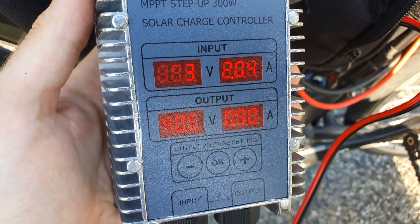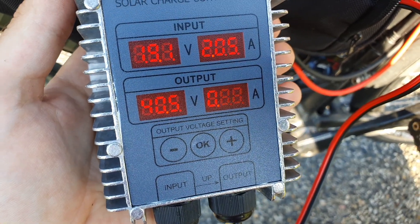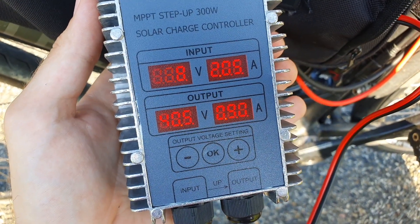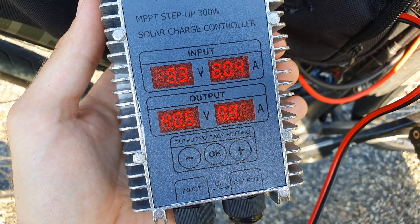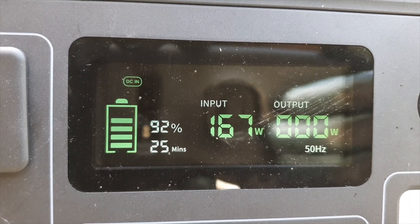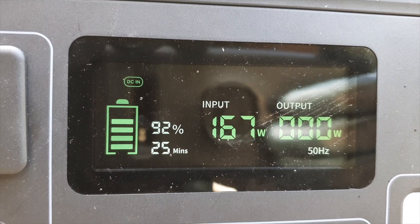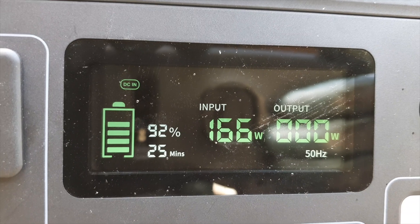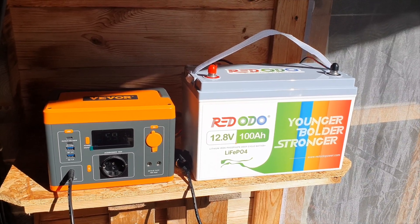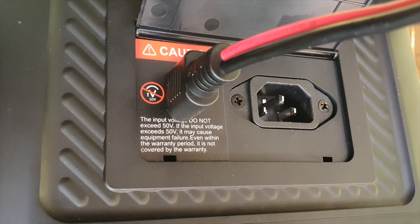One way I've researched: if you put a voltage booster in between the battery, the cabling, and the charge input, you can boost the charge rate even faster — kind of like a solar panel. You don't want to go over the amperage limit on the small charge controllers built into solar generators. But you can go quite high on voltage. For example, on the Vevor you can put 24 volts in — I believe that's the maximum. On my Fossibot I can go up to about 50 volts, though you should go a little under that and not run it always at max.